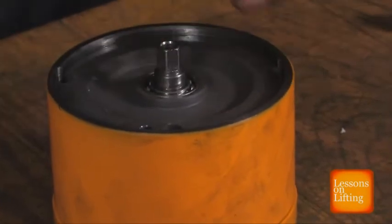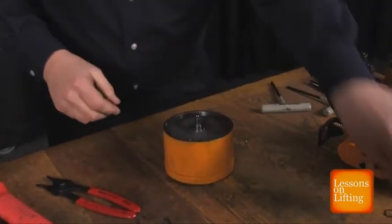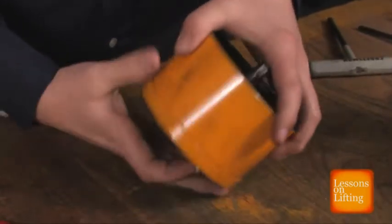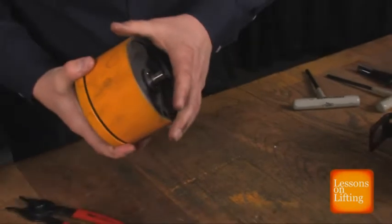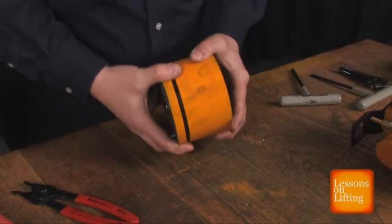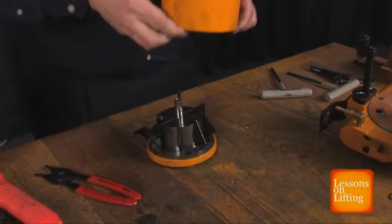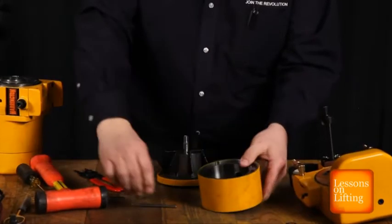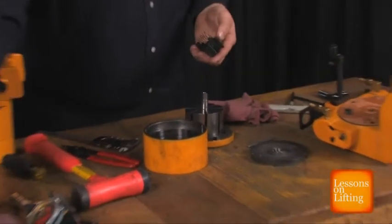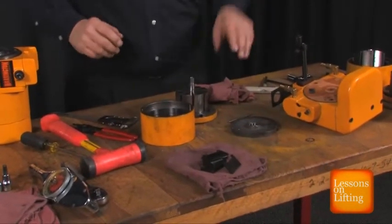Be very careful that you don't overextend the snap ring and stretch or damage it. We'll place that out of the way. The next step is to separate the rear plate and rotor from the front plate. When we do this, the vanes are going to come out. There, we've got the air motor basically disassembled. Now that we have our vanes and springs disassembled, we'll set them on a rag for later use.